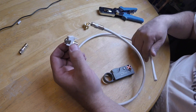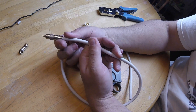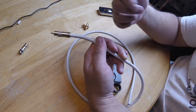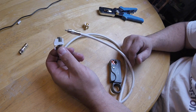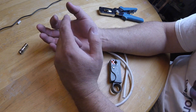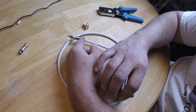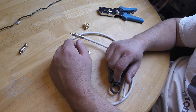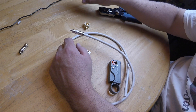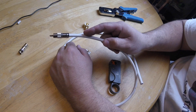One end of the wire is on your equipment rack and that one needs an RCA connector — it plugs into the back of your receiver, which also wants an RCA. There's no reason to do a keystone behind your receiver because you'll have a big bundle of wires there: speaker cables, cable box wiring, subwoofer cable. Hopefully you just have the wire come directly out of the wall and go right into the equipment, because splicing speaker wires can come loose and you do lose some quality. So I bring all those wires right out of the wall with an RCA connector on the end that plugs into the back of your surround sound receiver.